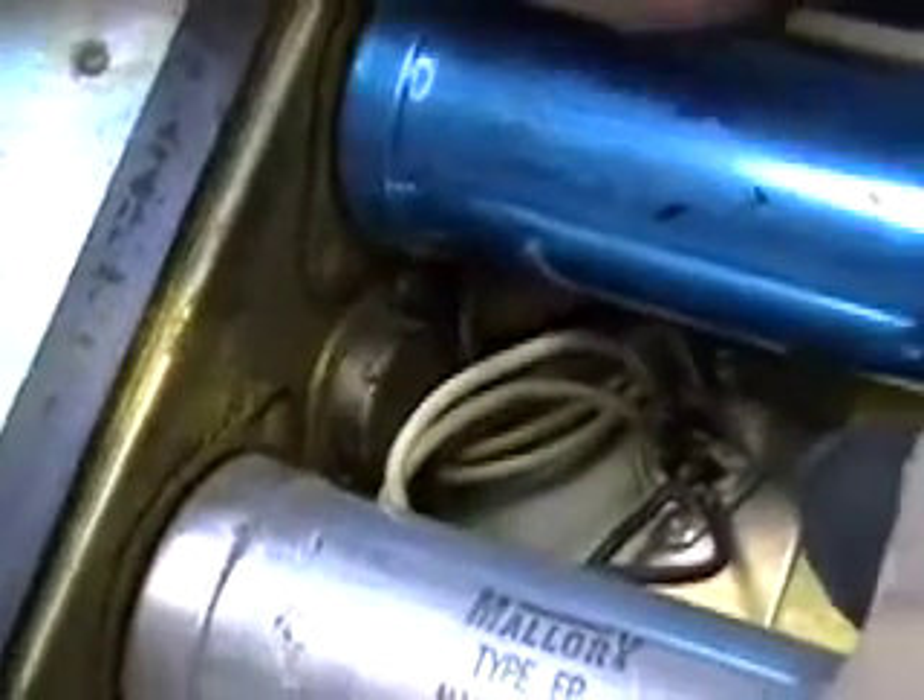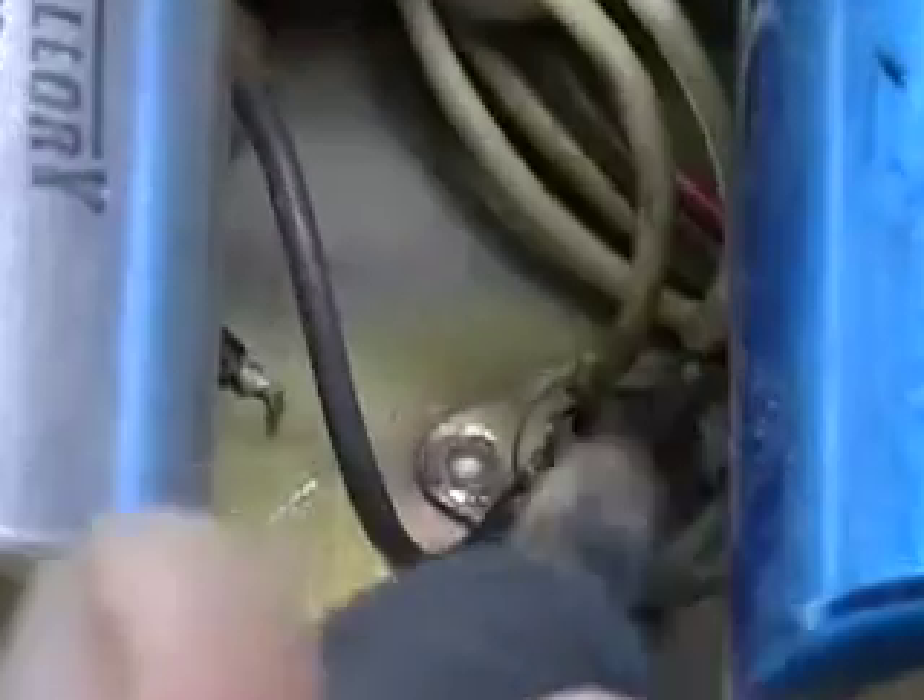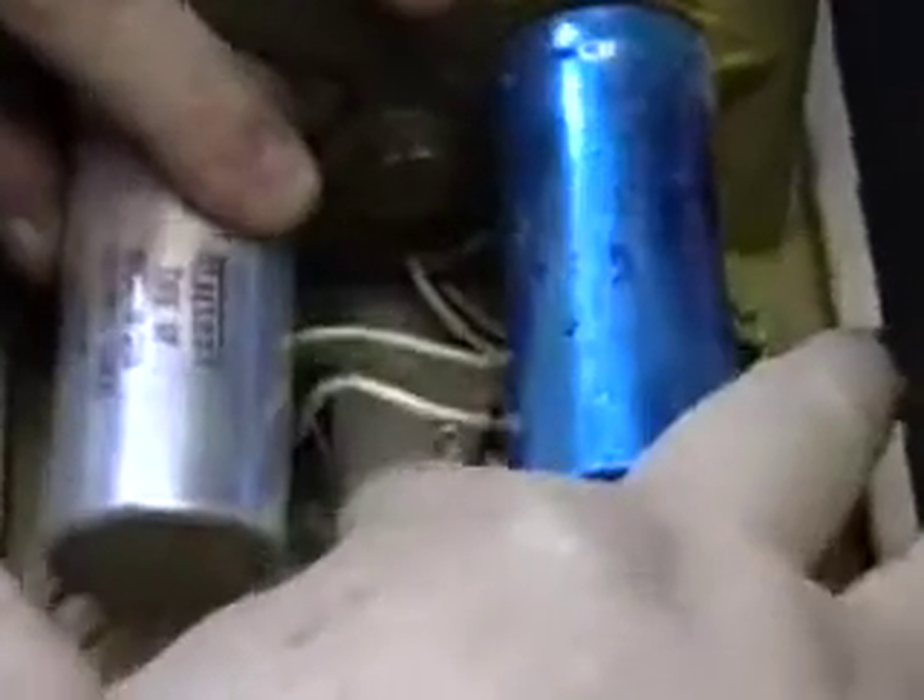You'll have to locate pin 1. Pin 1 on the 4-pin connector is down in here. We've got pin 1 released, and then pin 4 is going into the input — right here. That's been pulled out. That's pin 4. Pin 4 is ground, and don't disturb the black ground wire going to pin 4 that goes to the two output jacks here. Leave that alone.